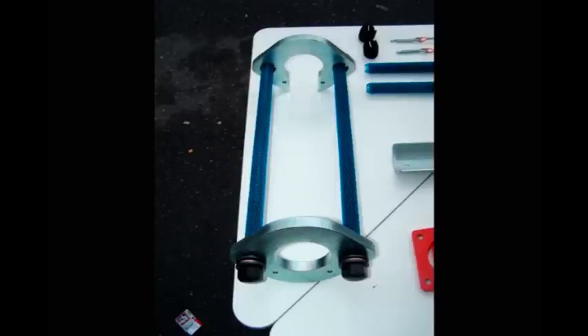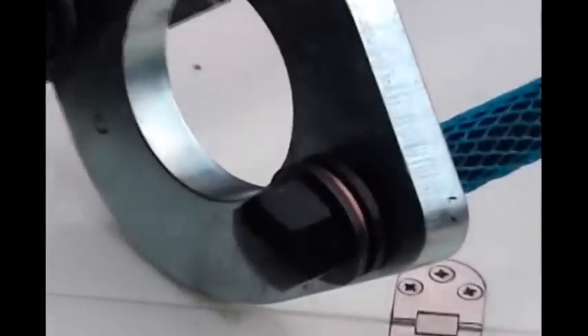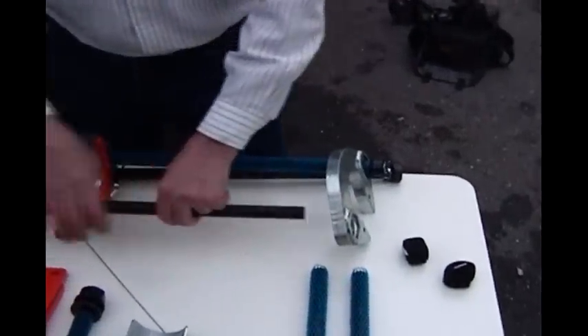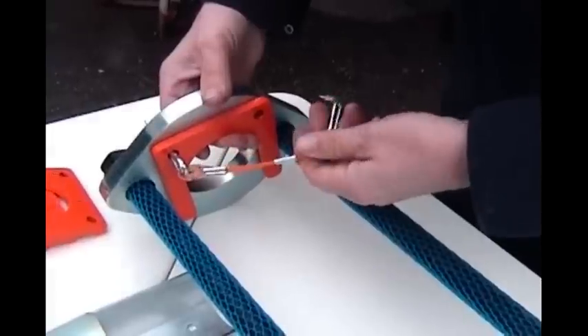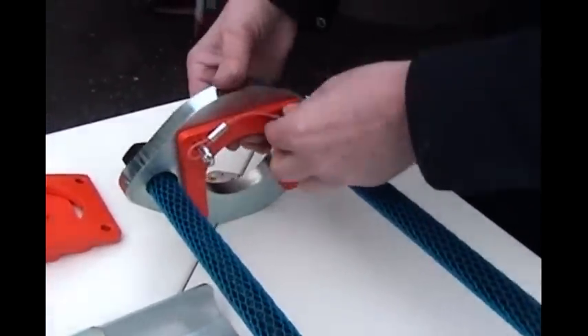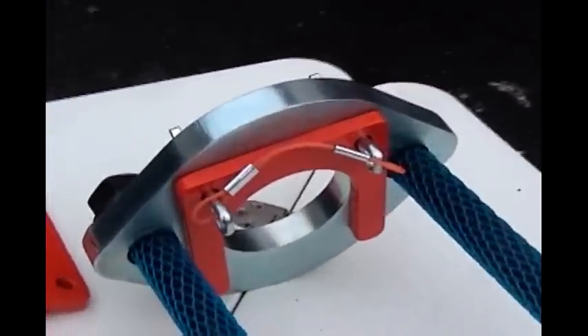To construct a puller assembly, lay the forward and aft yokes on a clean surface. First insert a flat steel washer, then the bronze thrust bearing, then another flat washer over each threaded rod. Insert the threaded rods through the yokes, starting with the aft yoke first and then through the forward yoke. Attach the machined nuts to the threaded rods and insert into the forward yoke, positioning the nuts into the locking tabs. Use the cotter pins to attach the horseshoe matching the outside diameter of the bearing to the aft yoke. Do not attach the forward horseshoe at this time.